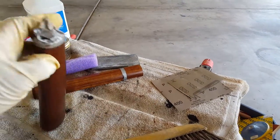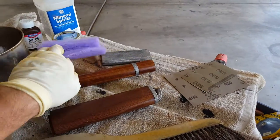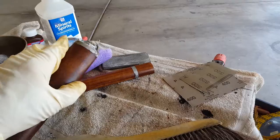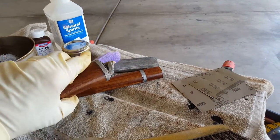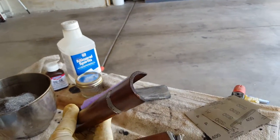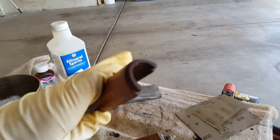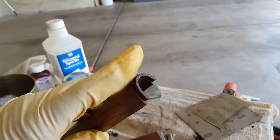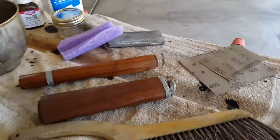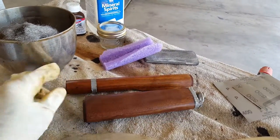As far as the process itself: I did a 220 pass with a flat surface, then went with the noodle at 220, then 320, then 400. There's a piece of metal on the stock — I covered it with duct tape and the sandpaper went right over it. On the edges where they form right to the metal pieces, be careful: if you're too aggressive you'll put a divot there and the metal piece won't sit flush. You don't have to be aggressive with this — love it, because this is something you're going to have for the rest of your life.